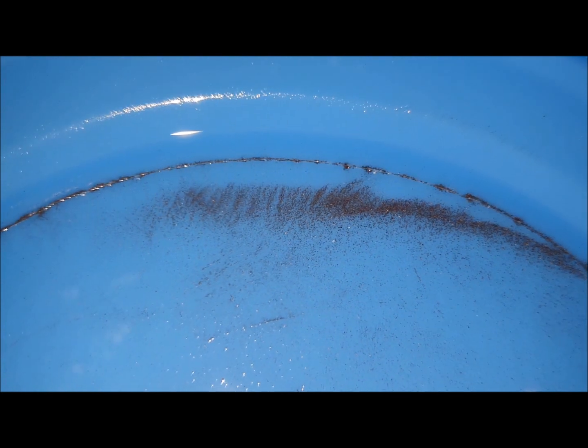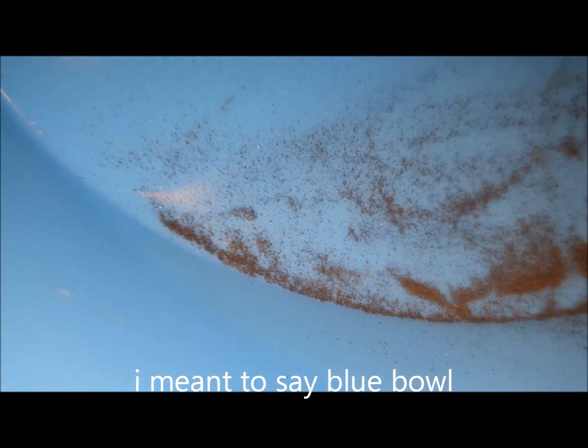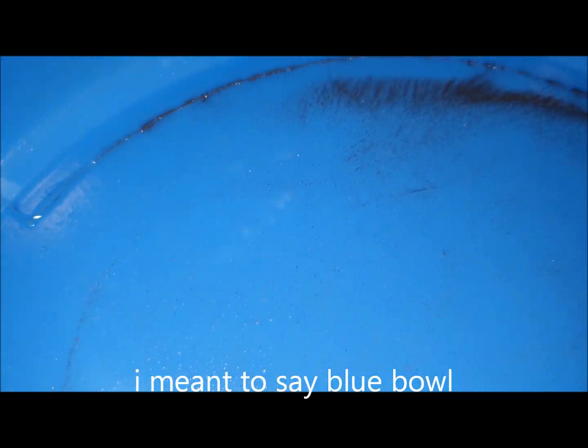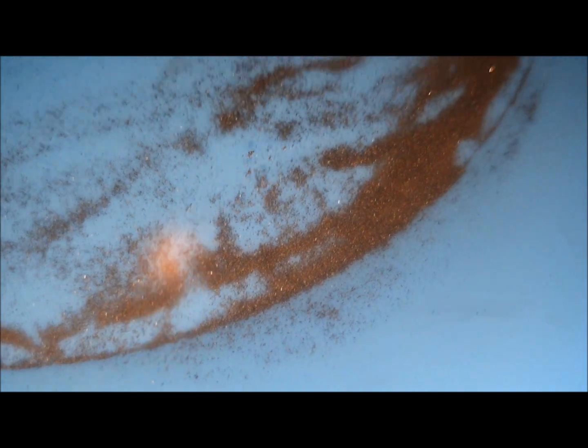And like I said, statistically I'm supposed to end up with 27 grams. It certainly doesn't look like it based on what's in here and what's in the beaker. I reckon some of this gold is so fine it's even hard to see. So I'm going to run it through the gold cube very, very slow. And even then, I'll probably still put whatever goes through the gold cube into nitric acid and then aqua regia and see what I get, because it could be so fine that it goes through anything you do.